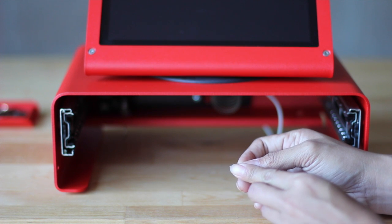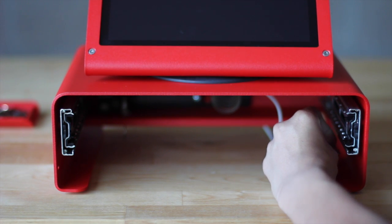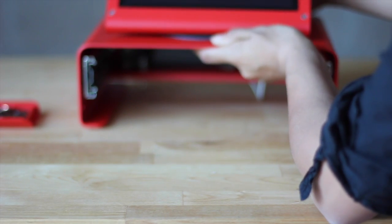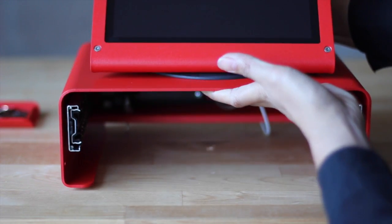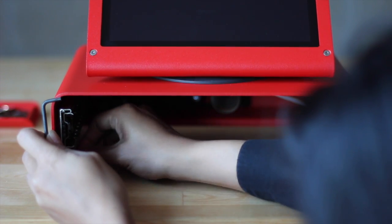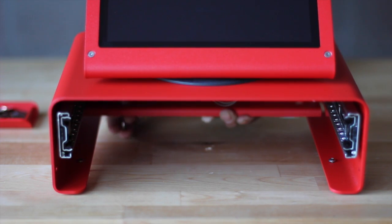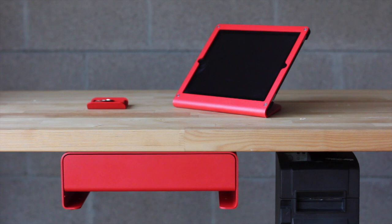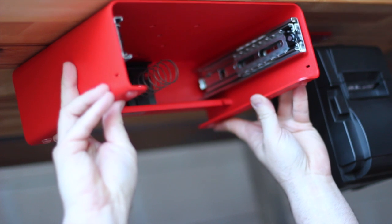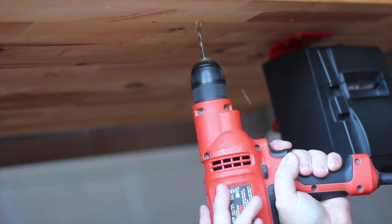Use the countertop screws to mark the hole positions. Drill pilot holes for the screws. Use the tool provided to install the screws. Leave some slack in these screws to allow access to the mechanical override. Have a friend hold the cash drawer in place under the counter while you mark the holes. Pre-drill holes for the screws.